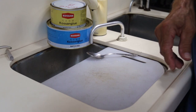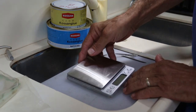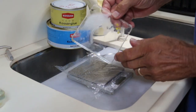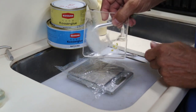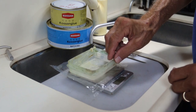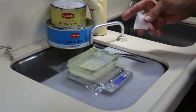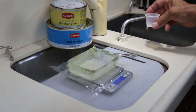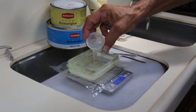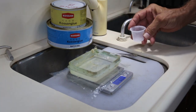The best way to mix glue is what another cruising friend showed me, and that is with a kitchen scale. It's very precise. When you go to use it, you should put a piece of plastic over it as a drop cloth — if you don't, and you drop some glue on it and try to clean it off with acetone, it turns into a bigger disaster. Put a container on top that you're going to be mixing your glue in, push the button to turn it on, and it'll zero out. I can put in a certain amount — I'll put in two cups here. That brings it up to 60 grams, so I know I just need 30 more grams, making 90 grams total, to have a two-to-one mix.